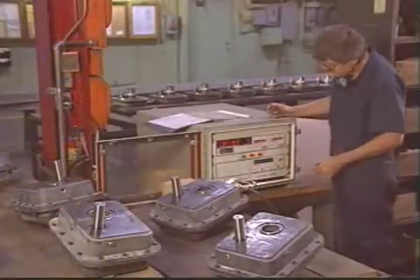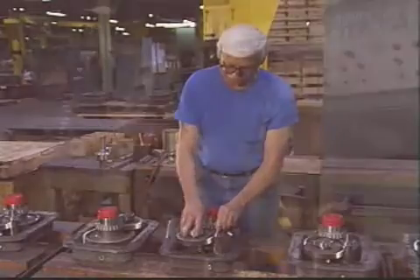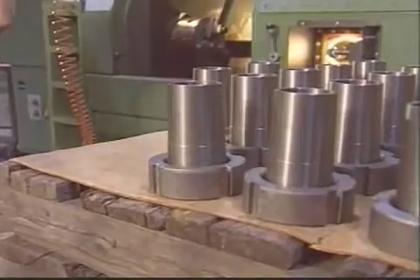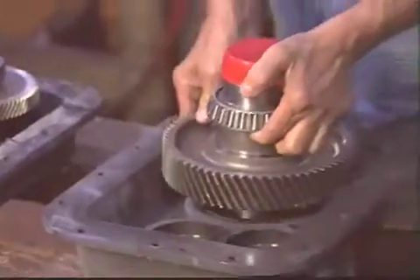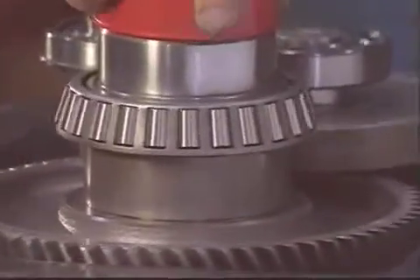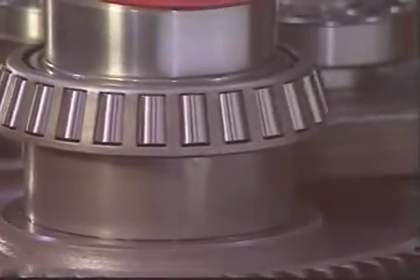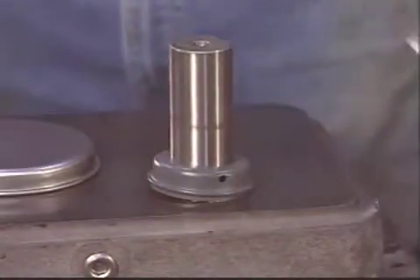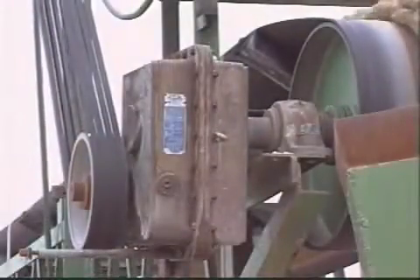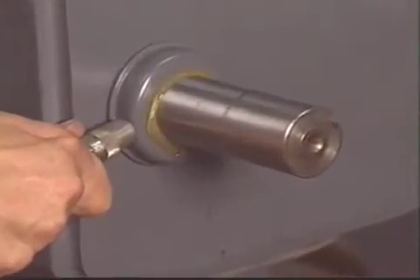Falk's new quad-drive 4000 J-shaft mounted drives are typical Falk in design, engineering, and manufacture. Quad-drive parts and components are precision machined in dedicated manufacturing cells. Where others have cut corners, Falk has opted for features that ensure trouble-free operation. Big, heavy-duty bearings provide exceptional load capacity. A severe-duty seal, standard on all quad-drive units at the high-speed shaft, keeps oil in and dirt out. A grease barrier traps contaminants and can be purged when head shaft bearings are greased.